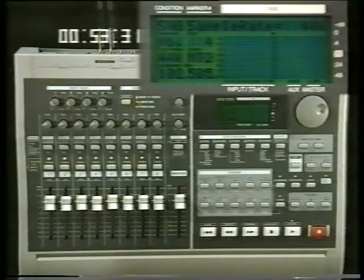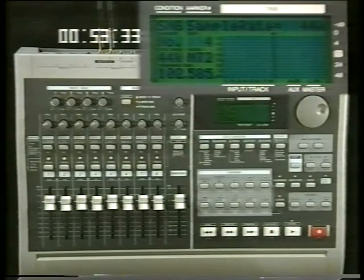You may be aware that different digital audio systems use different digital sampling frequencies. DAT, for example, can use 48 kHz, 44.1 or 32. CD uses 44.1 kHz. So that's the frequency that I choose to use more often than not, because it means I can import and export audio more effectively, since sample frequencies need to be matched for transfer of audio within the digital domain. Okay, so my sample rate there says 44.1.